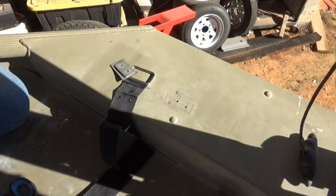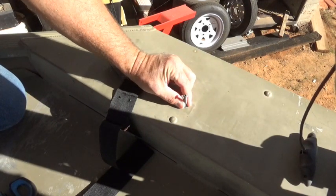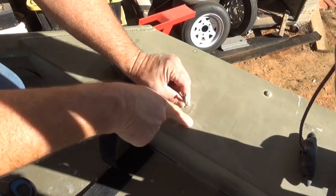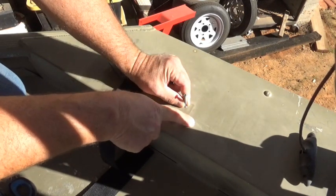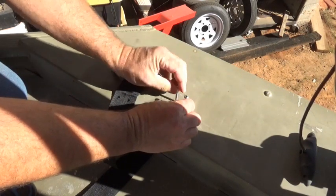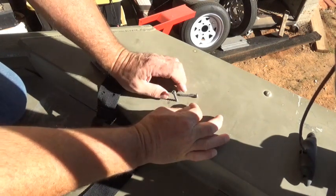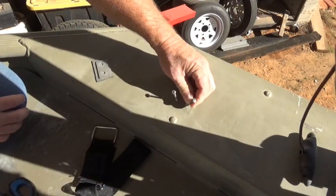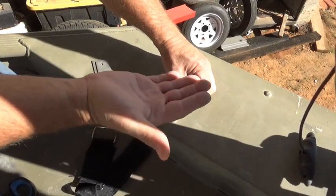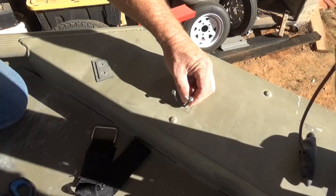The second thing you want to look at when you put one of these in: you can place your screws in straight up and down and all you have is the threads of your screws countersinking into that plywood underneath. I would not put these in straight up and down. I would put these in at a slight angle — that way it's not just the threads you're pulling against, it's actually the screw biting at an angle, which makes it a lot harder to pull out.